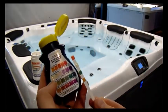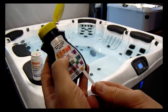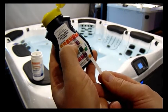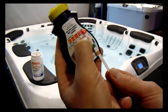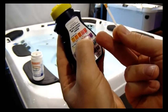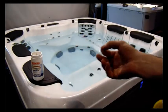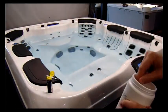Now we're going to have a look. We can see it's no longer acidic water because we raised the alkalinity — it will naturally push your pH scale higher. That's why step three is to bring the pH down. It's sitting at about 8.2 to 8.4 on the chart, whereas it needs to be down near about 7.6. So we're going to add pH decrease. The drop from 8.2 to 7.6 is 0.6, and every 0.1 of a drop is one teaspoon of pH decrease. So I'm going to add 6 teaspoons of pH decrease to the spa water.